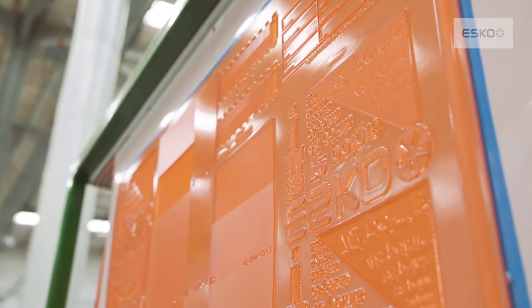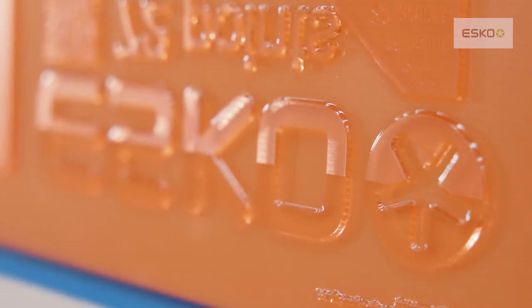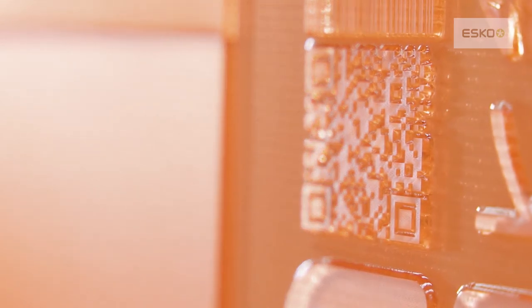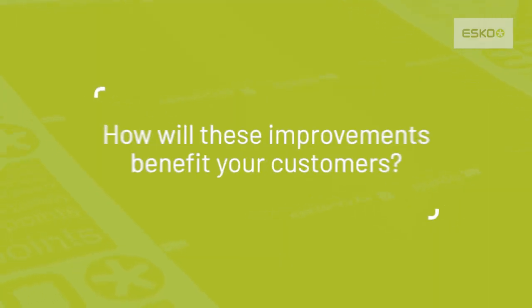In addition, Print Control Wizard gives us sustainability improvements, allowing us to print good quality on low-grammage paper. We see improvements on plate performance using Print Control Wizard — it works particularly well with the softer corrugated plates and the new generation type that's hit the market over recent years. We have seen Print Control Wizard bring up to 20% savings on ink formulation cost. We can take work that was historically pre-print or litho into the post-print sector.